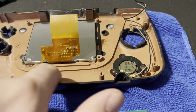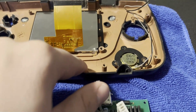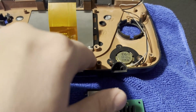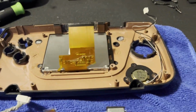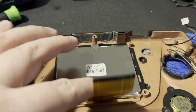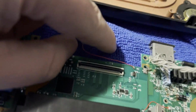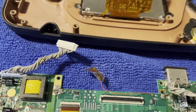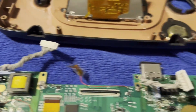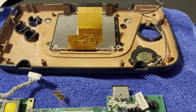Because I put my meter on continuity mode, and this is all a ground plane. So this is like conductive paint. So you gotta sand that out of the way to put your touch buttons here for PT1 and PT2. I have to solder the other one on. But yeah, I'll go ahead and put this together and then show you guys the final product.